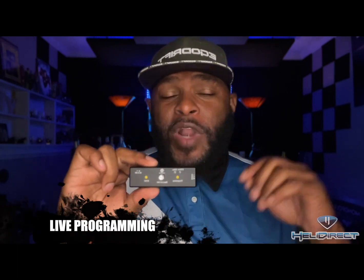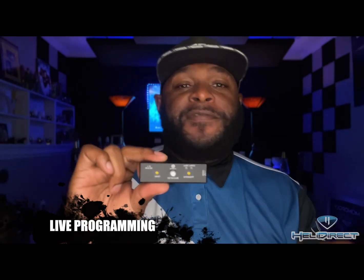You select whether you want to run 1520 or 760 pulse, then hit Enter to lock it in. Then you turn this little dial until you get exactly where you want that servo to be at neutral or zero, hit Enter, and you're done. Live programming — you don't have to re-power it up to see if it's where you wanted it. It's where you put it. Servo locked in.